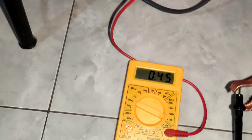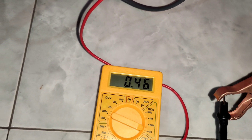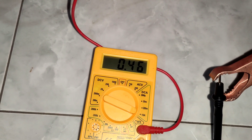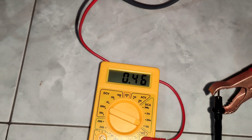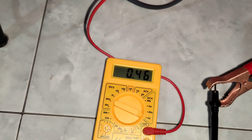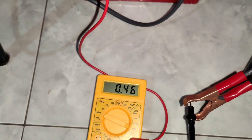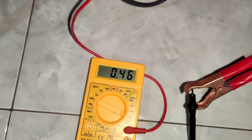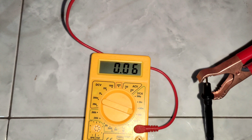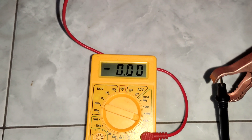Let's switch off the power supply to the UPS so it goes to power-consuming mode. Now you can see it's turning to about 0.4 ampere — with no appliance connected to the UPS, just idling, it is drawing around 0.4 to 0.6 ampere. That's almost close to the charging power it was putting in. Now switching off the UPS — it's dropping to 0.06 ampere and going to zero.